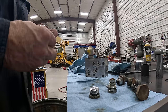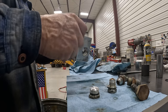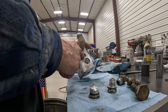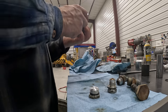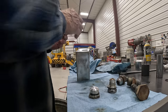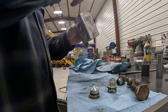Okay, I am cleaning and assembling these valves. So I tried to get this pipe plug out of here because it just comes up in, and there's a passage from this port, goes over through and down into this one. Then the last one that I took apart, that was full of goopy oil, water, junk. But I broke a 3/8 drive Allen head deal off, so I got out an impact one in the 1/2 inch Milwaukee and it wouldn't even touch it. So that is not going to get cleaned out. So I've washed it and washed it and washed it. Tried to force some down that little passage. Anyway, I'm hoping I've got it cleaned out. I guess we'll find out when it don't work, huh?